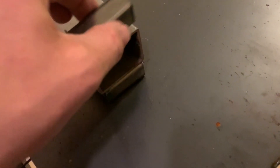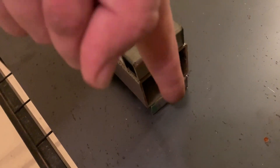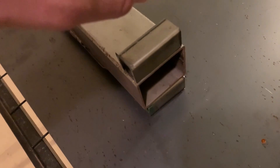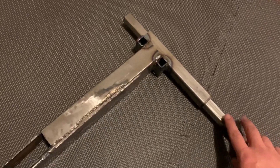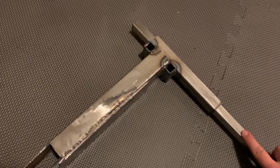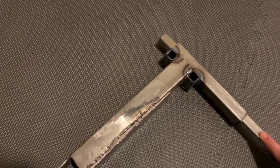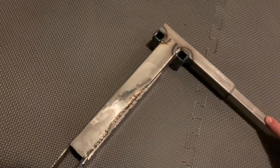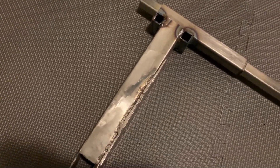My two pieces are cut out — I just cut out two little chunks like this. I'm going to weld these here and here, and then my bigger square tubing will go straight down vertically and my smaller square tubing will go inside of that for the adjustments on the head. I'll cut this square tubing and get an adjustment on my lawnmower. It will be adjustable to any length once I put the holes in and put some screws in there to hold it in place.